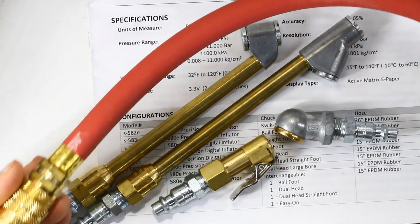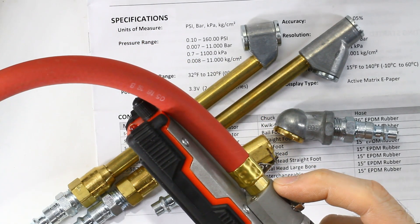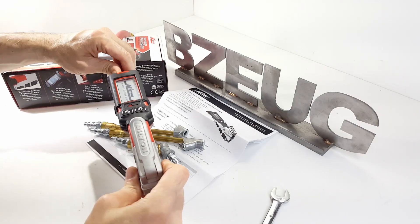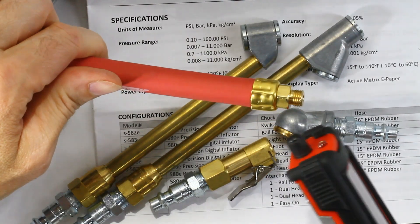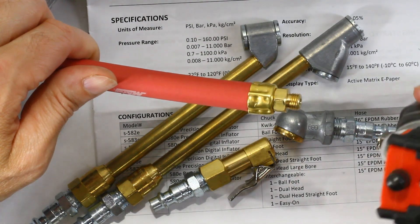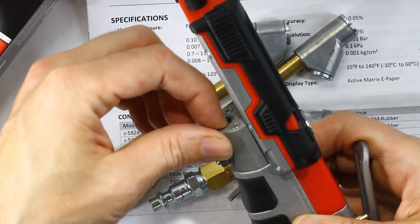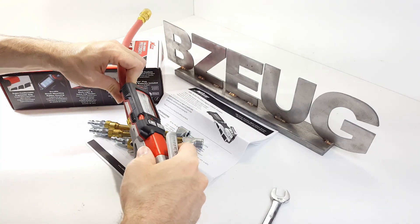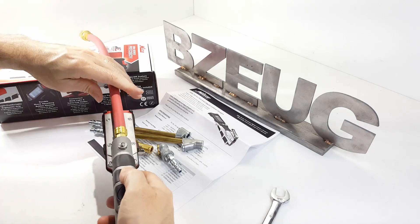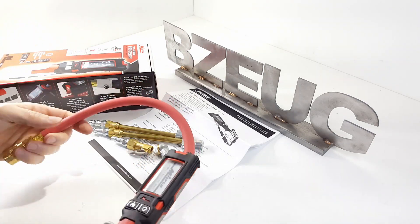It comes with a really heavy-duty tail. The instructions say to put the tail onto the inflator with no Teflon tape, and there is no O-ring on this either. That fitting has no O-ring, which I'm a little confused about — it seems like the type of fitting that has an O-ring. It just threads onto this end, which is just flat, not beveled or contoured. I'm following the instructions and threading this on with no Teflon tape, just snugging it up with a half-inch wrench, and not over-torquing it.